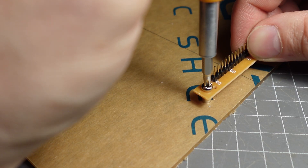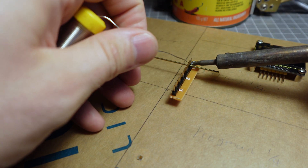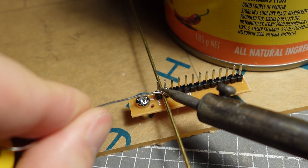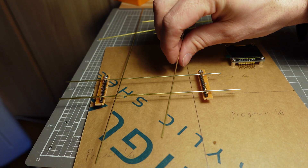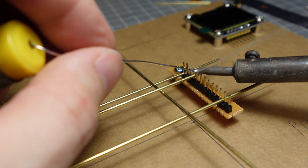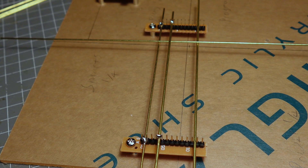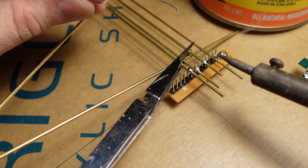Once these are mounted onto the plastic, I can run some brass wires between them. This will have four wires: one power, one ground, and then two signal wires to run between my LCD and the brain of the project. I tend to solder across two pin headers, which gives good contact and allows me to attach from underneath. The double-wide spacing gives me a little more room when attaching other components. The extra pieces of brass wire underneath help to lift these up and space them vertically as well as side to side, allowing easier routing of contacts between the battery, power, and the microcontroller.